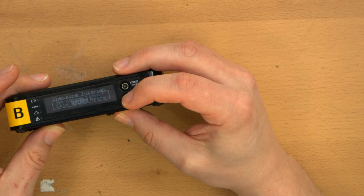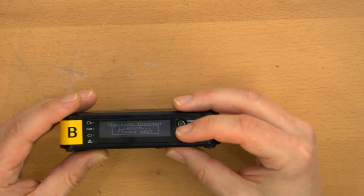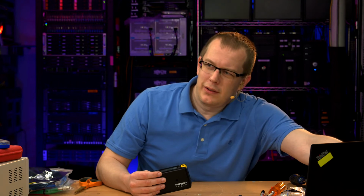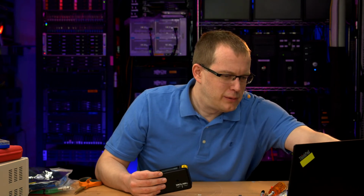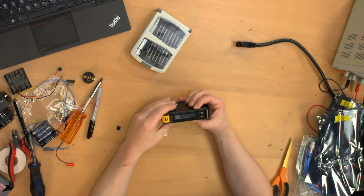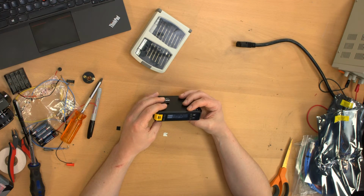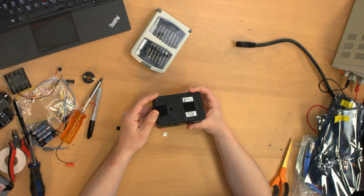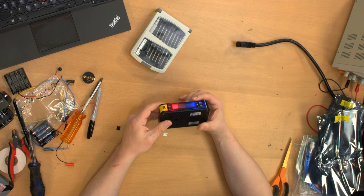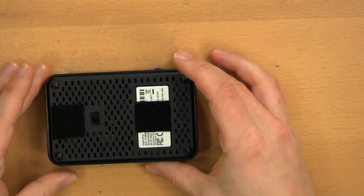So like this has a menu, but there's nowhere in the menu to disable the battery. Unlike, for example, this Lenovo Carbon X1, it has a built-in battery, but you can actually disable it in the BIOS. That's, I guess, for maintenance purposes, and probably for safety purposes if you're messing around on the inside of it. Not that I've ever shut the battery off, but it's at least an option. Unfortunately, this doesn't have that option. So, hence, disassembly is in order.